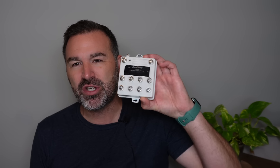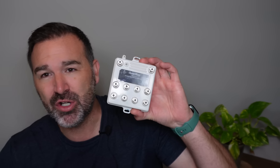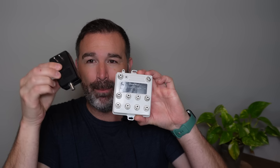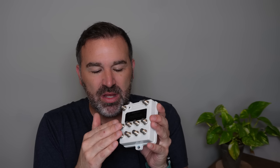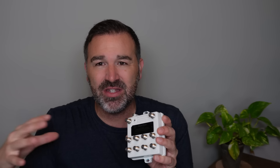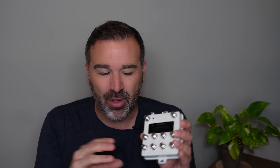The second thing we're going to use is a power splitter. This allows us to connect one MoCA adapter into the power splitter and send the signal out eight ports. A power splitter has one port that provides power using a power brick. I like a power splitter because when you amplify the signal, you get better results — things like cable age and length can play an issue. By amplifying that signal, you have better results, but you might only need two or three ports, so shop accordingly.